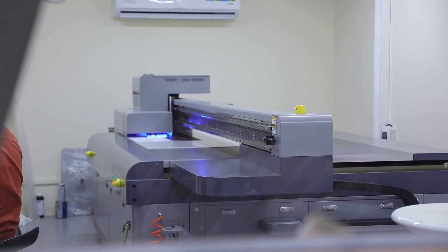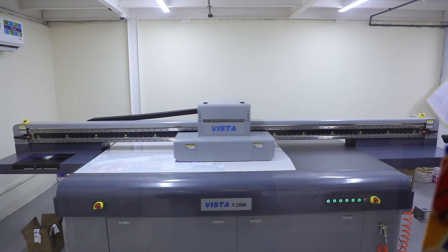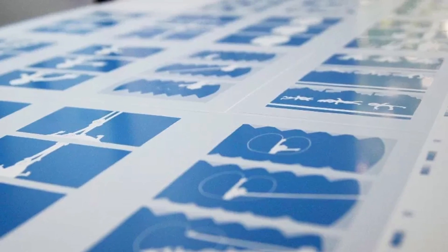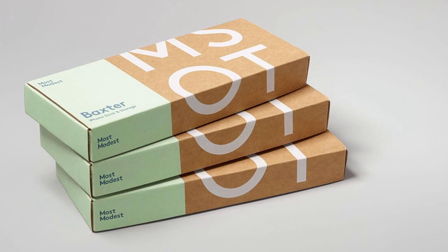With a total of 1280 nozzles, the ink droplets of the Ricoh Gen 6 are 5 picoliter to 15 picoliter and the maximum frequency of gray levels is 50 kilohertz. Adopting internal heating, Ricoh print heads ensure that the ink temperature is stable, the service life is long, and usual maintenance is relatively simple. The exclusive Panasonic dual Y-axis motor keeps high resolution and stability in the carriage, while the unique start-stop motor technology guarantees stable printing. The V2800 covers a wide range of fields such as advertising printing, plate processing, architectural ceramics, decorative floors, packaging cardboard, and many more.